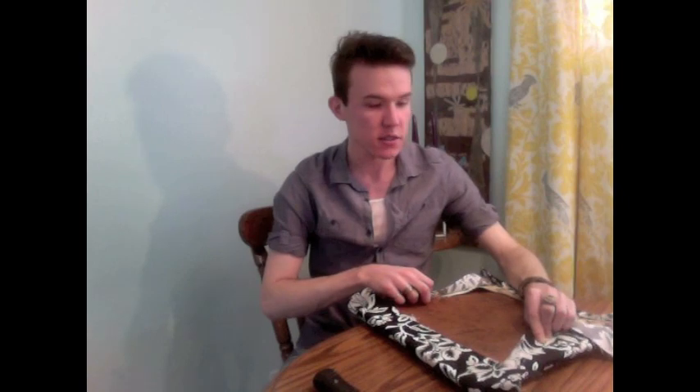Looking at the back, on either side you've started from, begin working from the center out toward the corners. This is because if you get any bubbles or wrinkles in the fabric, you can work them out to the corner and just fold the fabric to hide them. Think of it like sweeping all the dirt into the corner under the rug. After you've got the two sides attached, put staples about an inch and a half to two inches apart — you really don't need that many, and it's always good to not be wasteful. Then repeat that on the two remaining sides.